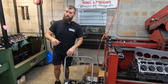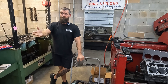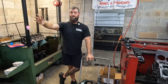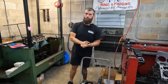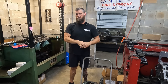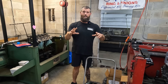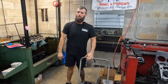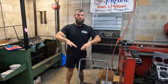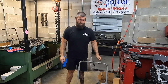The same thing is happening in some cylinder heads. Around the exhaust port and exhaust seat, the casting is paper thin — there's no room — and that thing is just moving and going crazy. We talk about valve seat concentricity and all of that — we want zero runout when it leaves here, but at temperature it's doing all kinds of freaky stuff.